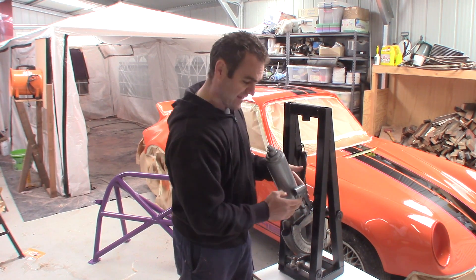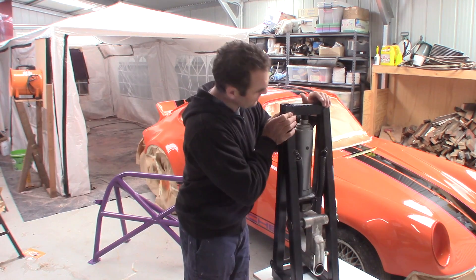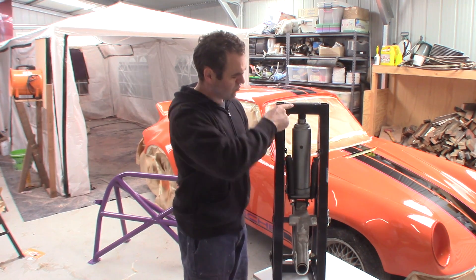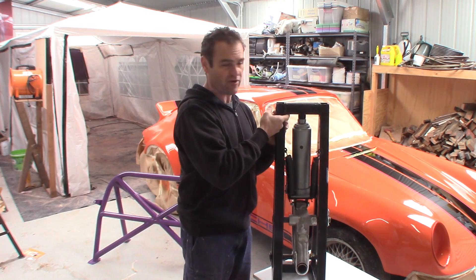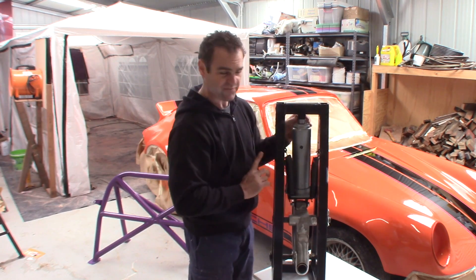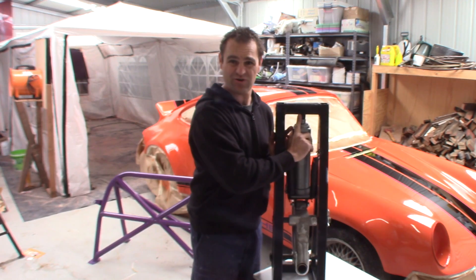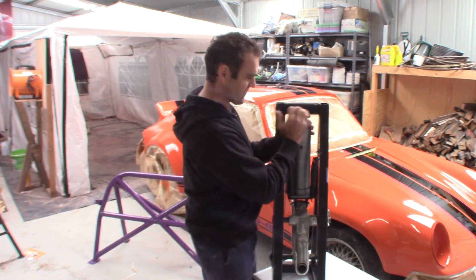I did also note that on the top of the bender here, I've actually welded onto the square tube a piece of 3mm angle iron that reinforces this whole top plate. Because obviously with the jack, all of the force is going into this top plate, so you want it nice and strong. It may be a bit of overkill, but that's the way I've done it so it will withstand all the forces involved.